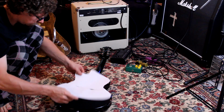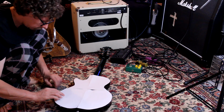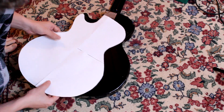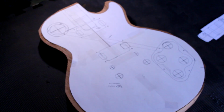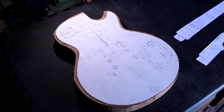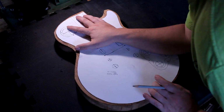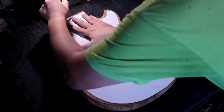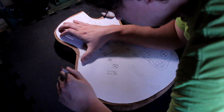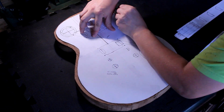If you have a guitar to check, it's the greatest thing to throw it on top of there and see if it's not exactly the same size. Once again, the edge will be radius, so check the sides. Now you can use this template as a size reference and fill in all the pickup routes and all the knob and bridge pin locations, etc., etc. This also gives you a proper size reference for your neck templates, but my personal suggestion is get all the templates you can find for whatever guitar you're building and cross-reference them against each other.